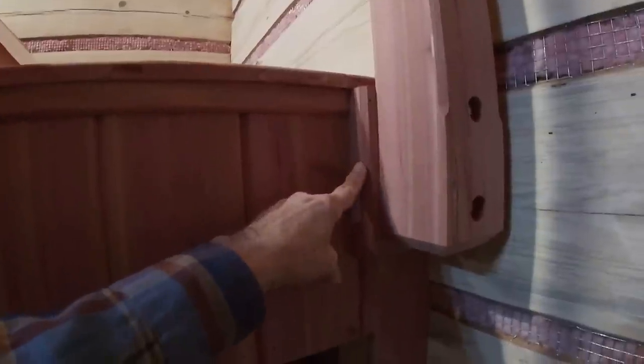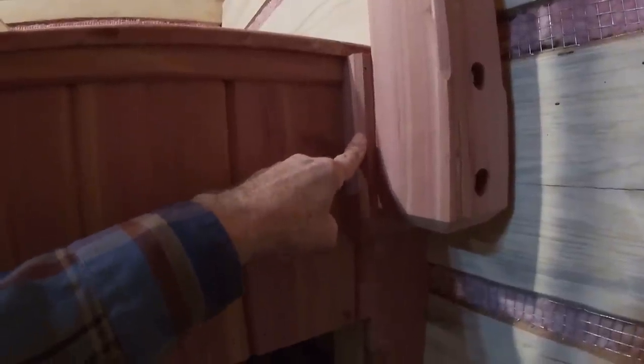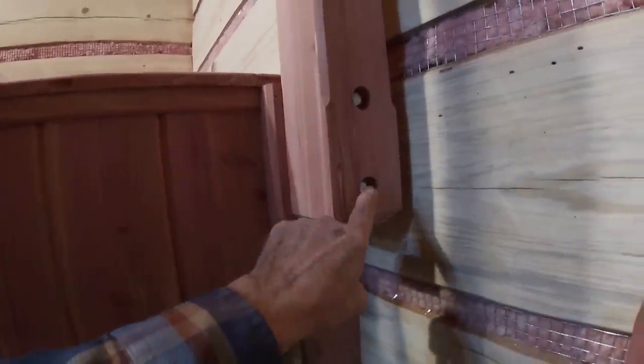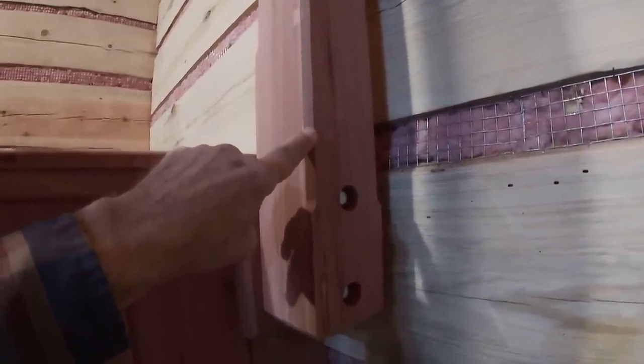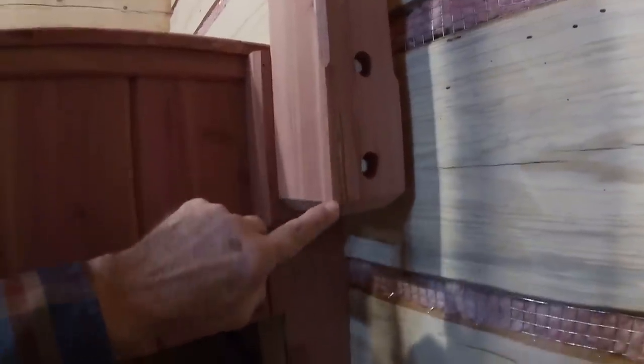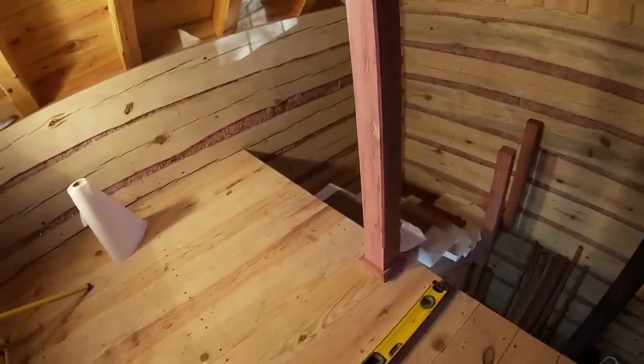And so I've got a block here that I attached to the backside of the post. And then I anchored this, just shot it on there with my nail gun. Then I drill through and put 8-inch 3/8 lag bolts that go through everything and into the step framing right here. I'll show you a little bit of a detail. I put a chamfer on the corners. It comes up 4.5 inches from this bevel. I just cut this bevel right here on my miter saw on the bottom side, just so it wouldn't look so square.